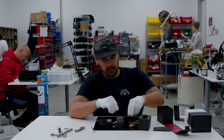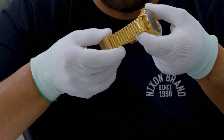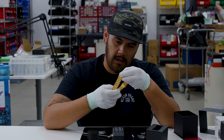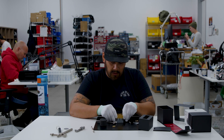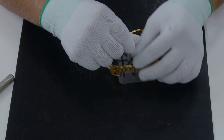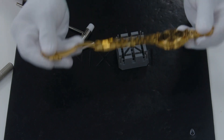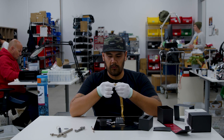Now we're going to take this link and connect it to the watch bracelet. We'll open up the clasp and repeat the same process. You'll find there are sizing links on the bracelet that have the same arrows featured on the extra links, and we will tap out one of those link pins. We'll place the whole bracelet in the band block and push out one of these link pins, slide it out, and open up the whole bracelet.